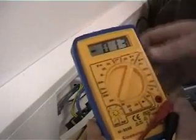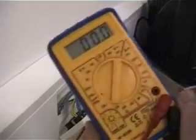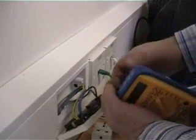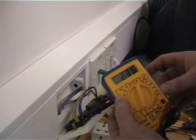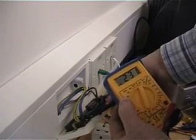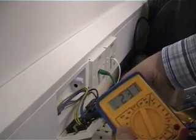General power sockets and voltage in a house will be about 240 volts, so you'll see the display there registering 000. What you want to do is take your black and your red — which are your neutral and your live — touch the live to the brown, the black to the neutral, and you should see it starting to read. Now it's obviously over range, so the range is now set to 600. The voltage is below that, and we're getting a reading there of 231 volts. That is about normal.